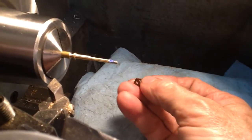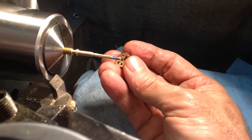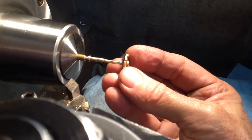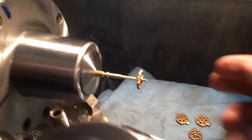I've also filed several of the spindles square. This is in lieu of putting the straight knurls on them. All I did was drill a number 44 hole through the handle and then I filed it square.